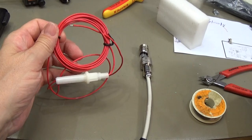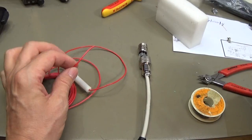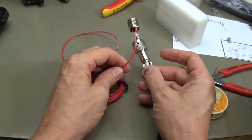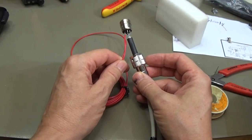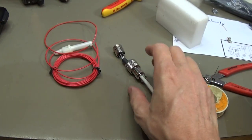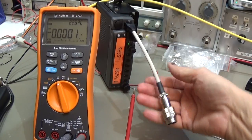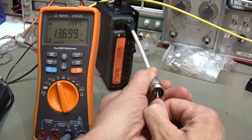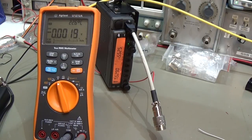Well, the only logical way is to really supply our voltage from outside, and so therefore I try to bring a plus line into my microphone connector and just connect it to our pin 6. And then we take it directly from our radio input voltage, and then it should work. Okay, so I have now my direct power supply, and let's see what we have now on pin 6. And you see now we have 13.7 volt. And that should be definitely fine.